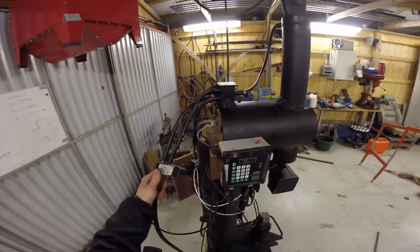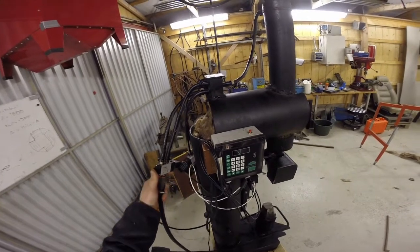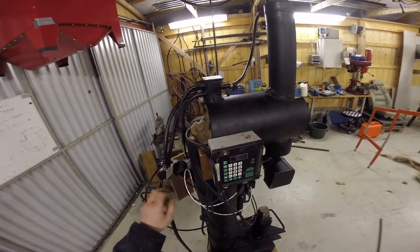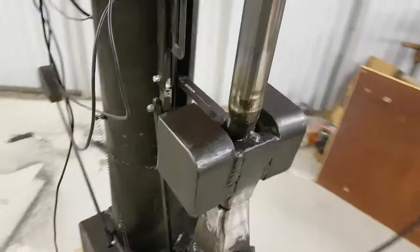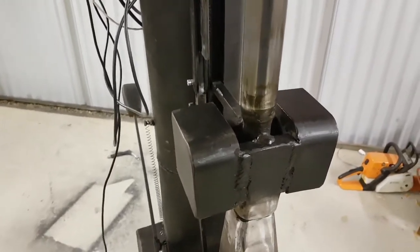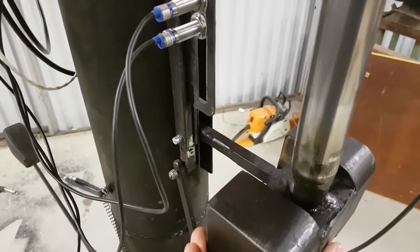On this side we have the solenoid valves — the cheapest I could find from Wish, about one euro each. They run very smooth and are controlled by 12 volts. The only problem is the inlet and outlet diameters are very small, so I had to use two of them in parallel. The piston is just lightly welded to the frame, and I have an old sledgehammer split into a hammer and anvil with some extra weights added — around 10 kilos in total. There is also a guide rod to make sure it doesn't rotate.